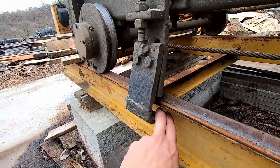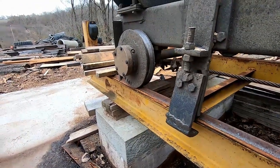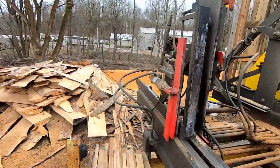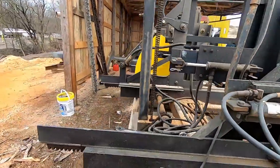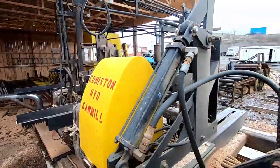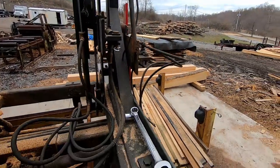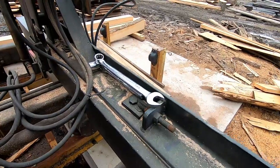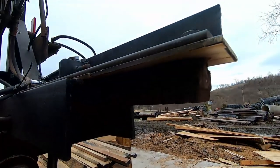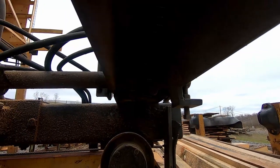And this guy here has fingers. There's three of them. And once it gets to this point and touches that track, it can't come off. When you're rolling a log, you're basically coaxing this carriage to roll over. And then on the back side of my tracks at the log deck, there's like a bit of a ledge that they had welded on. I don't know if Edmonston did that originally or if the owner of the mill had done that. And then when you get back to your actual head blocks or your L's, the way this thing works is there's a rack and pinion system that feeds the knees in and out, and there's the gear assembly.